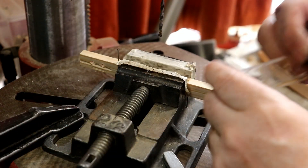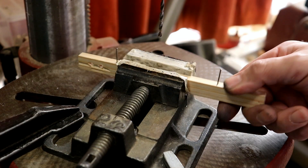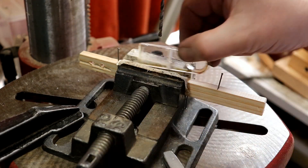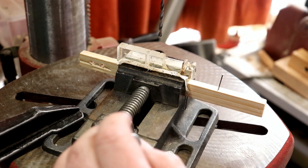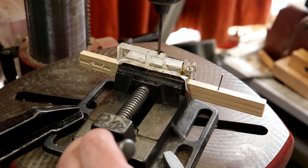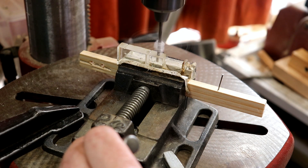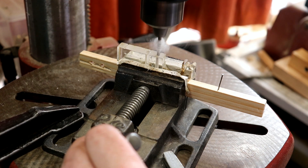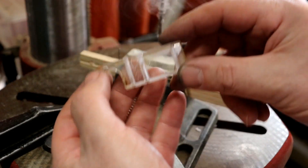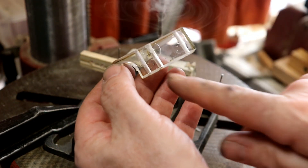With the addition of two new pins I can now put that in and a new drill bit, slide it up there and then drill one of the 3.3mm holes that I'm going to tap. There you go - all the necessary holes. Now I'm going to glue this bit on and then tap, tap, tap.